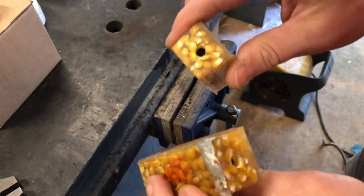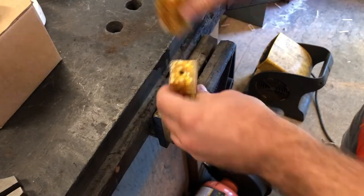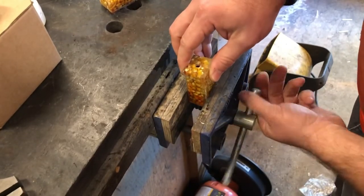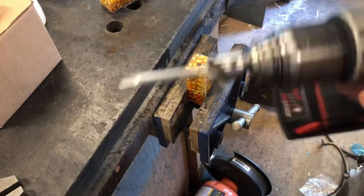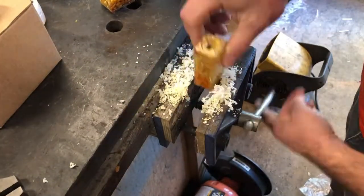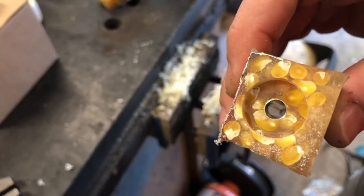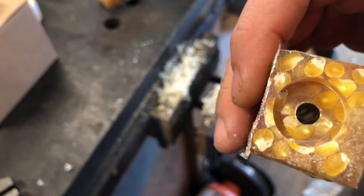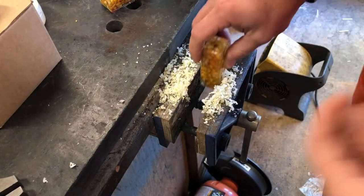The tubes are epoxied in and dried, so I'm going to go ahead and clamp them in here and use a barrel trimmer to get these trimmed up where they need to go. With a barrel trimmer, you can see the shininess on the end of the brass tube — you just go until you barely nick that, and now you're ready on that end. Then flip it over and do the other end and the other blank.